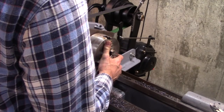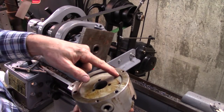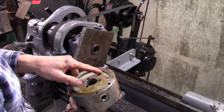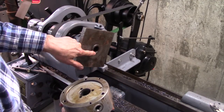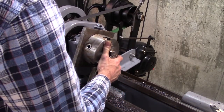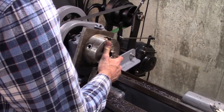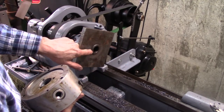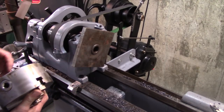Maybe not. Thing is, I'm going to cut a little recess — I call it a register — right there on this plate. I'll just have to be careful not to go too far, because I don't want that to hit this. Oh, that's going to be close. Can't cut much of a register. I didn't think about that — I started out with a one-inch thick plate.